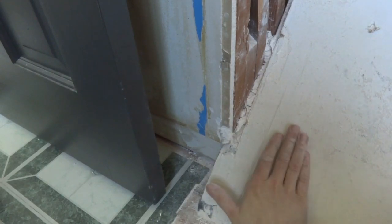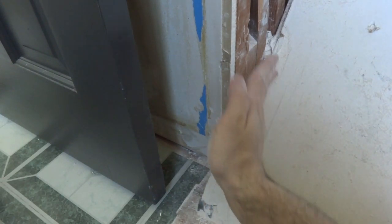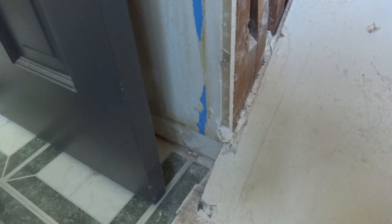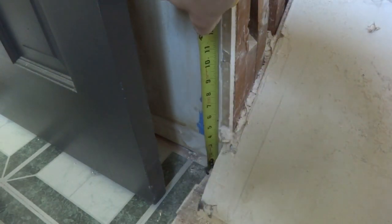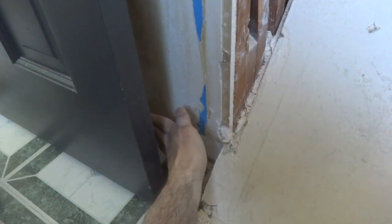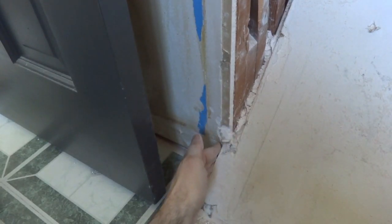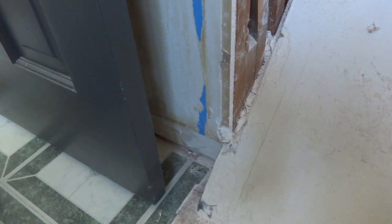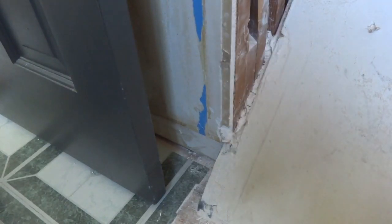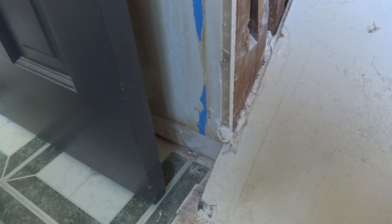It's a little bit of an eyesore but there's nothing I really know how to change. The one cool thing I noticed is that when I measured the height, it's shorter than our floor and wall trim is going to be. So I think when I do my floor trim I'll just wrap it here and kind of cover it up. It won't be the absolute best-looking thing, but it is what it is. I'll go ahead and start putting up my two-by-threes and drywall to bump this wall out.